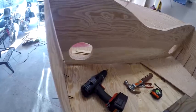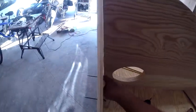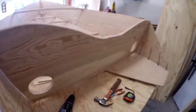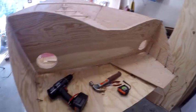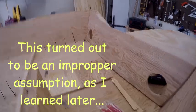I have to flatten the stern out and decrease this gap right here. The problem is I already have a massive three-quarter-inch gap on the transom, and when I flatten it out that gap is probably going to increase to over an inch or inch and a half. That means the transom simply doesn't fit, which is really frustrating — it means the original measurements given to me were incorrect.